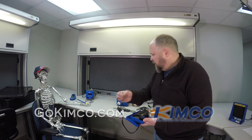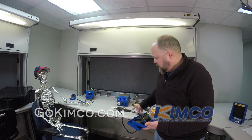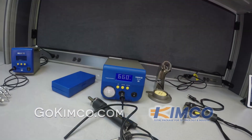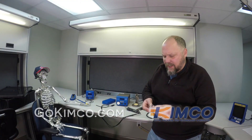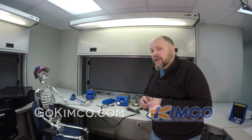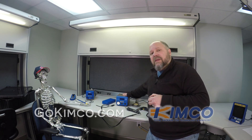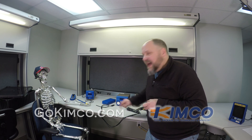This is the filter you see behind here, with some replacements. And this is another filter used inside the unit. You'll notice this one is clear — I kind of like that, because if you see some yellowing or discoloring, you definitely need to change it. What you want to avoid is getting any of those contaminants up in the pump itself. This is kind of your last line of defense.